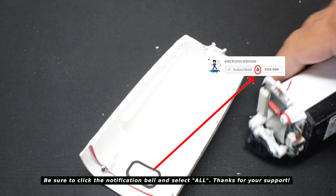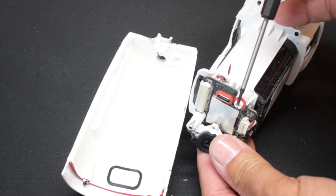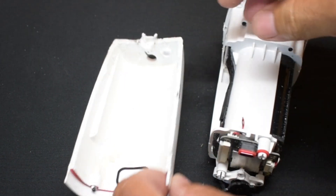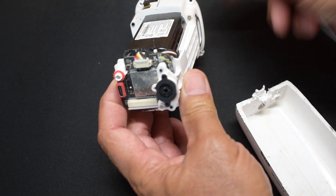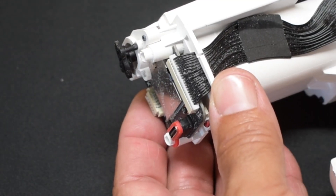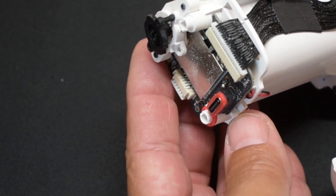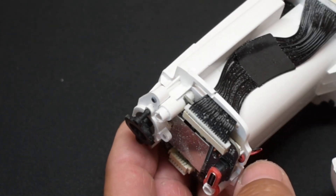In my case, the water must have entered not around the USB plug area — because there's a rubber seal over that as well — but it entered right by this rubber seal. You can look at the housing and see the big hole down here. The water found its way in through there, the board started getting wet, and down here you can see there's a little bit of water damage that caused the camera to fail. You can see there's some corrosion, some green. So this didn't happen overnight — probably the first time it got a little bit of water it found its way in, and over time it just kept accumulating until there was a fair amount to cause a problem.